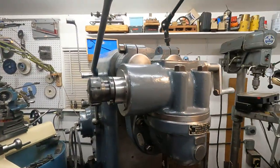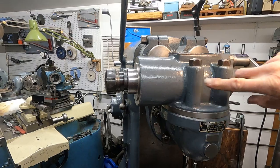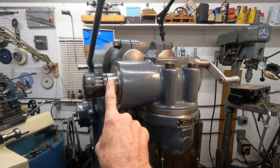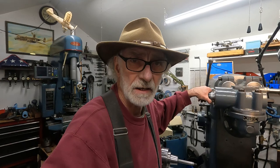You just kind of have to do what you got to do. An interesting thing — you can make your own spindles if you're really careful and get them round and stuff like that. I want to point out that this World War II milling machine has got a really deluxe vertical head with a quill that moves only a couple inches, but the spindle in this is not heat treated — soft steel. And I have to be careful with it. It was previously slightly damaged and I had to scrape the damage out of it.